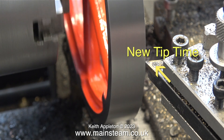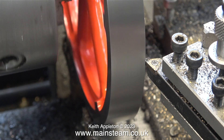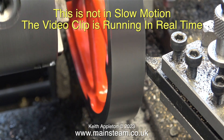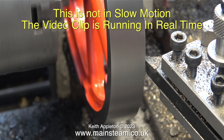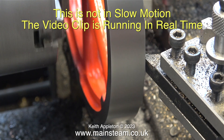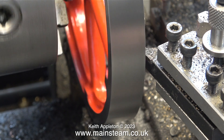It's not just that though — I've changed the spindle speed by engaging back gear and moving the countershaft belt onto different pulleys. It doesn't seem to be chattering now. It's at times like this that I wish I had power cross feed on this Myford. This chattering is caused by a combination of different factors: the spindle speed being too high and spinning the work too fast, as well as the rate of traverse and sharpness of the cutting tool. This is a very slow process.